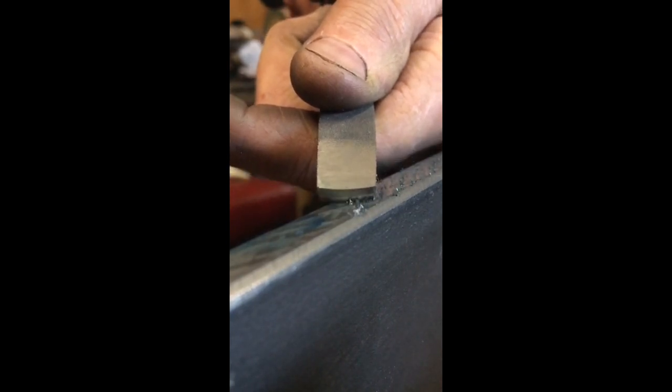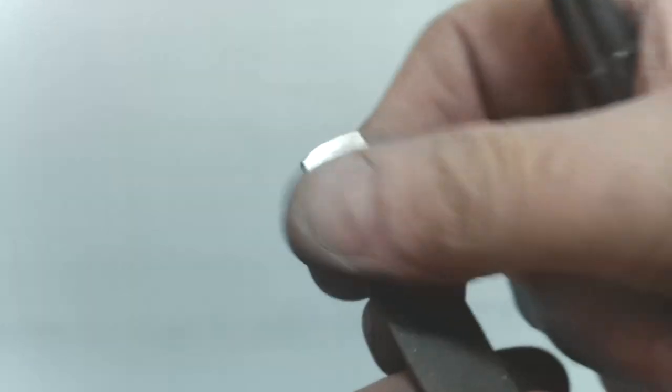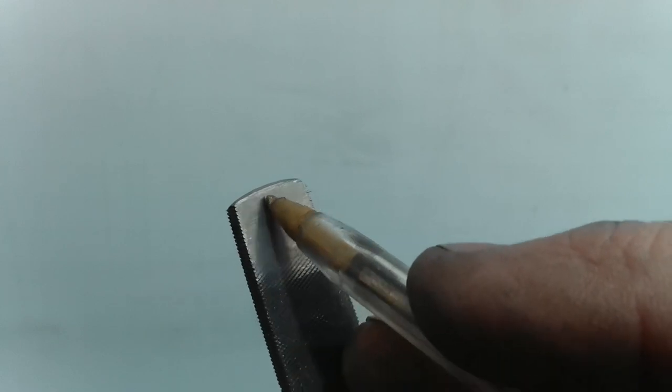I actually used old files to do most of my scraping. I do have one proper inch-and-a-quarter tungsten carbide scraper but the tip is almost ready for replacement. When sharpened, square-edged, and with a small radius along its width, they have a very keen cutting action on steel — though the removal rate is somewhat low. They're a completely different animal on cast iron though; they're the veritable JCB when it comes to cutting cast iron. While scraping steel I find that to start with the scraping angle is shallow, as little as 25 degrees. As the edge wears off the scraping angle increases until you start skidding off the workpiece, then it's time to resharpen the cutting edge.